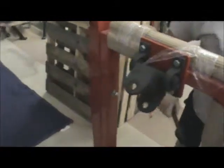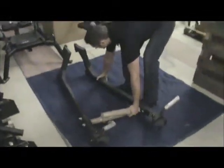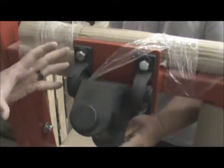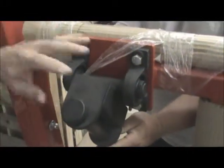And so when we go to put the unit back together, we know that those four bolts that held that pillow block bearing were lined up and they were good before we took it all apart. If you have to retune it from time to time, that's okay. But what I should know when I put this all back together is that it'll all be tuned.